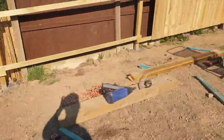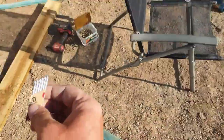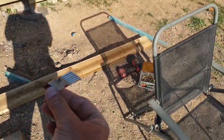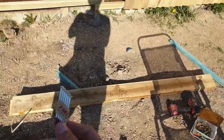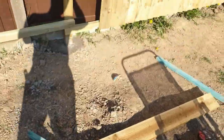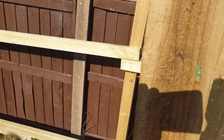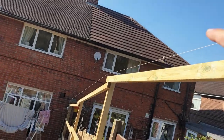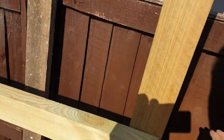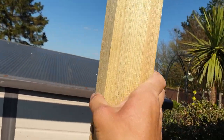Set the line all the way across, then you get to nailing. What you want to use — I'm using a roll plug nailer nail gun. These are 50mm Timco ring nails, rated for outdoor use. That's the smallest one they do, which is actually sufficient. The feather edge boarding is 1800, tanalised. All the materials are tanalised because it's outdoor. I've put 3x2 tanalised pieces on — these are 90mm — with a 90mm nail straight through into this 75x75 post.